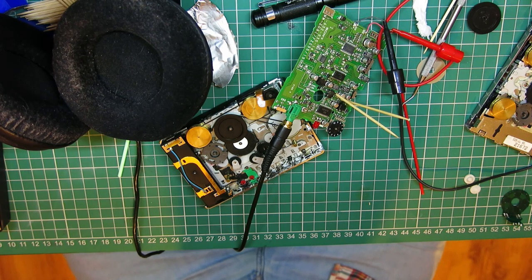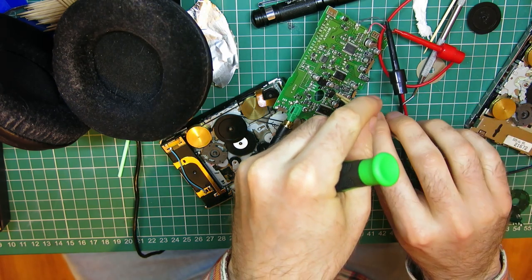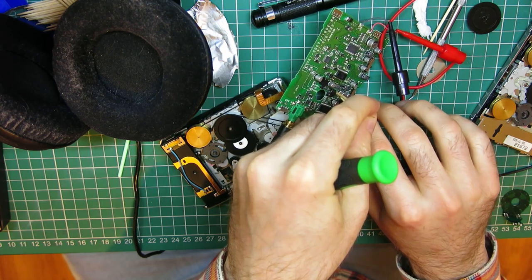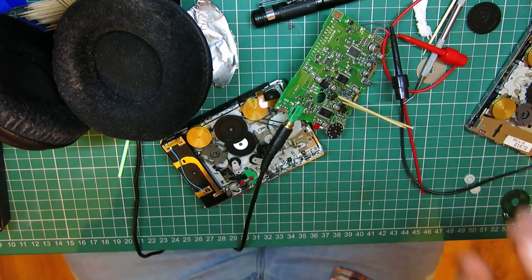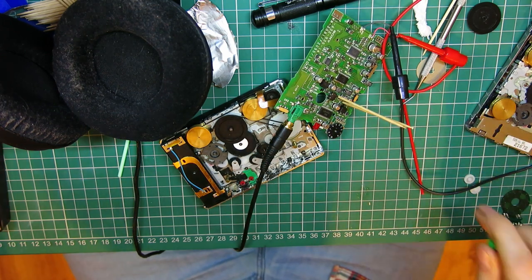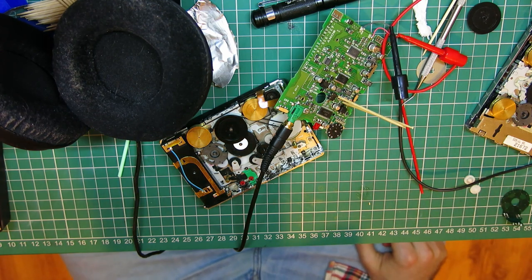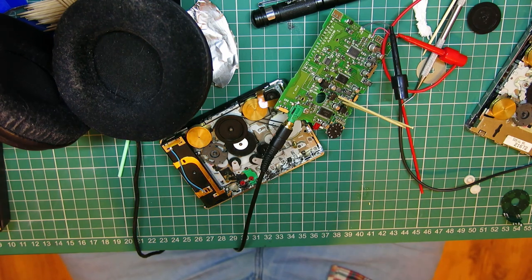but just to prove a couple of points, it does run mechanically, and the board capacitors are knackered, because if I put the power on and just trip these two switches on the board, turn the volume up, you can hear all the noise and static blaring out from the audio amplifier. So the usual thing of, just chuck a belt on, it'll be fine. No, it doesn't solve any of this. Doesn't solve the mechanical issues. Doesn't solve the damaged motor.